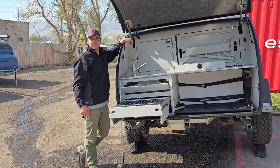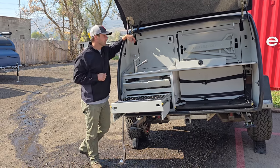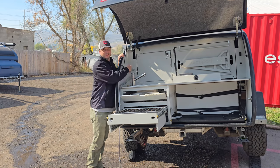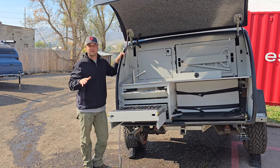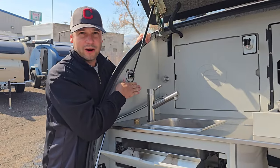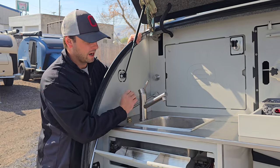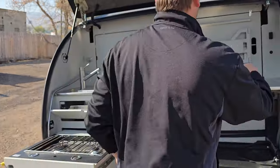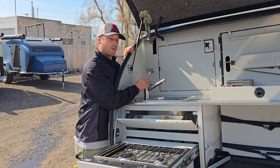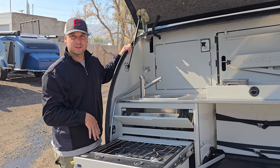Again in the neutral position, you can see we're allowing all the water to drain out of the shower. After we've opened the shower for about five seconds we're then going to close the valve, allow pressure to build for approximately 30 more seconds, and then move back to the faucet. We're going to rotate between the faucet and the shower until there's no more water coming out, or just barely sputtering out of either the faucet and or the shower. We've drained the shower and the faucet about three times now. Now that we have only air coming out of our faucet we are going to turn off the water pump.